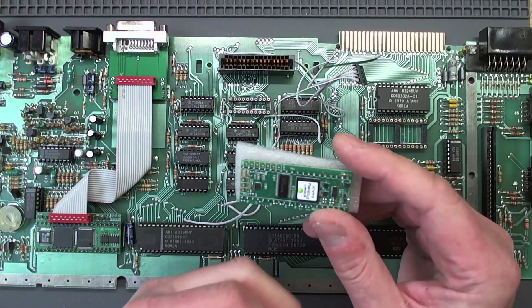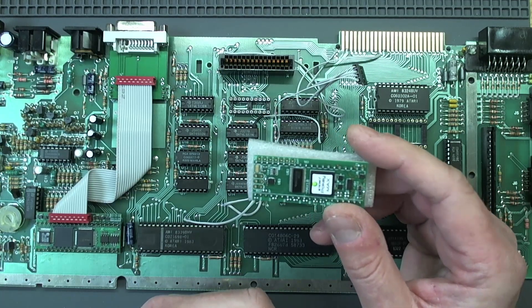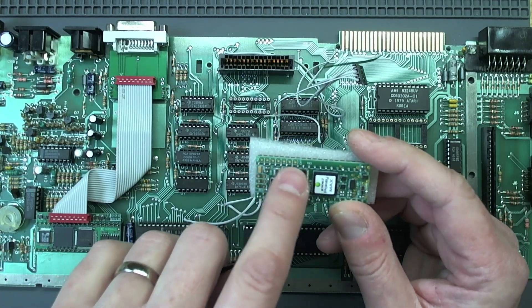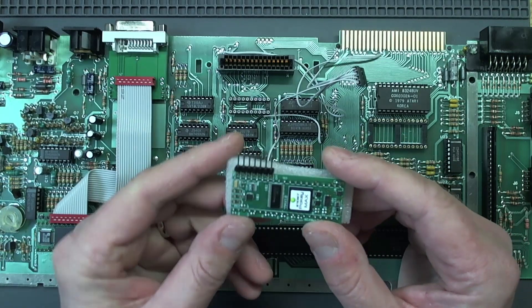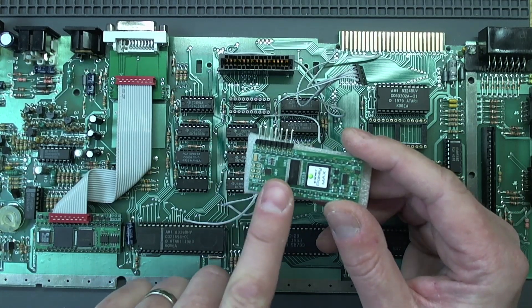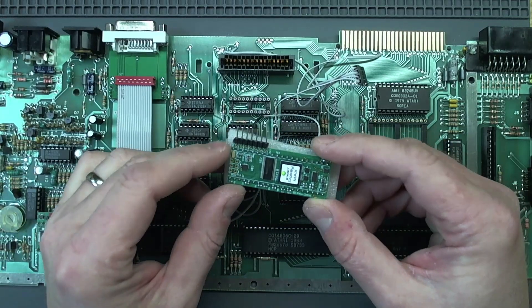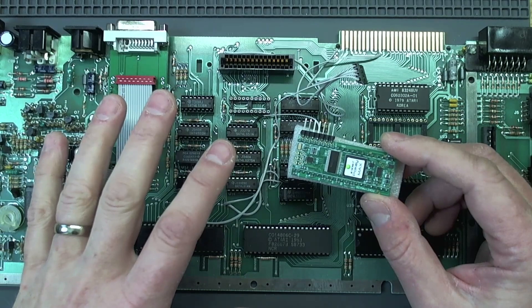When installing Pokimax, we have a choice of cores: SID emulation, Covox, PSG, quad Pokey, etc. A lot of the different cores require different signals on this 7-way header. We can ignore the first one because that's specific to the 1088XEL, but we've got another six external signal connectors. I'm going to solder this connector on and also populate the header so I can flash the appropriate core, because the customer bought the bigger chip — that gives them license to have whatever core they want.